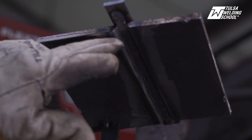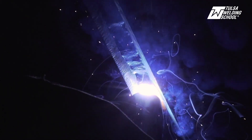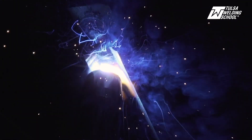Alright, so we're going to weld along the toe here, going to bring it right to us like we did in our root pass, and we're going to keep it moving. Now, you want to stay away from the edge of your bevel — that's your guideline. Keep that beveled edge.